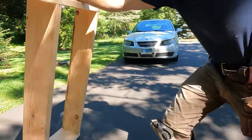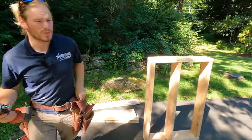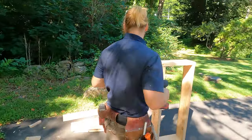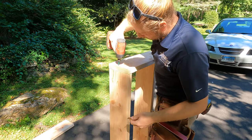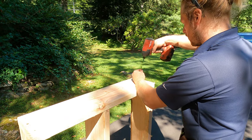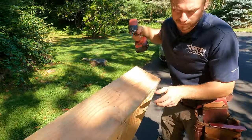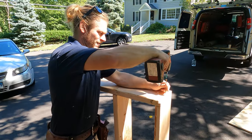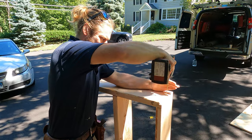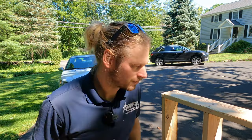Next thing is to flip the box up. I lost my impact — it's right here. Next we want to put four screws, one in each corner. That's going to keep the nails from pulling out when I'm whacking on the box to try to get it inside the hole. Doesn't really matter where you put them, just one in each corner. Charlie might be right about us being down to four hours. That's one box — we have to make two more since we have three skylights.